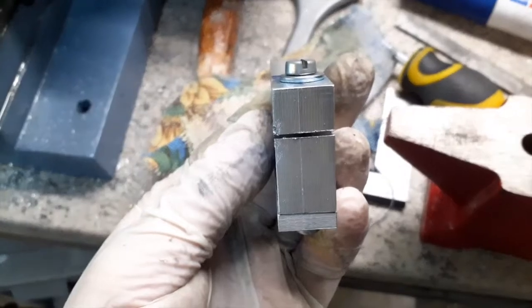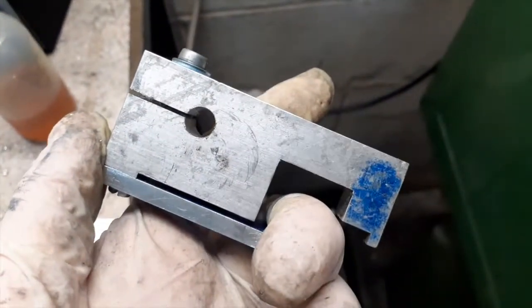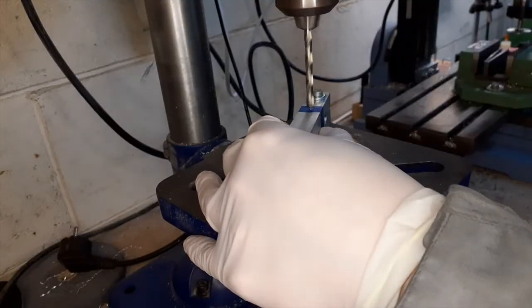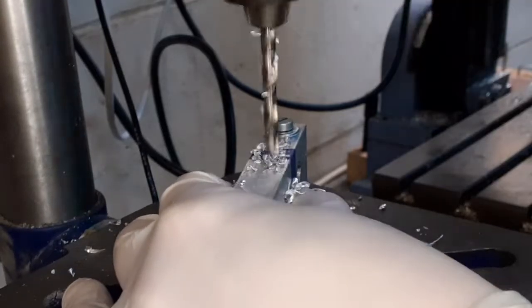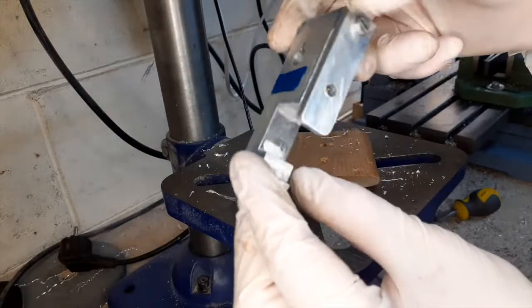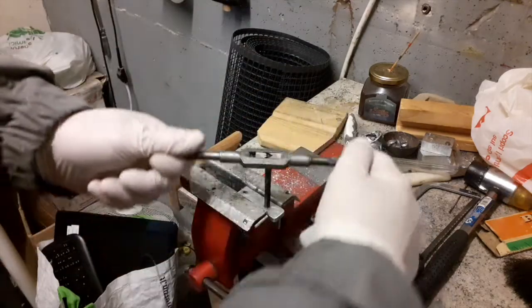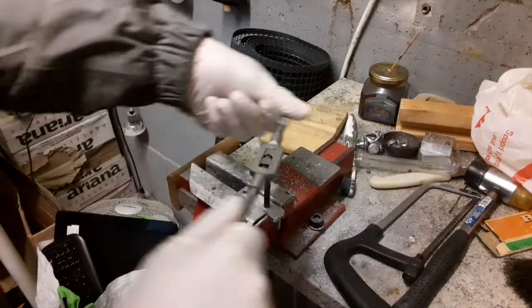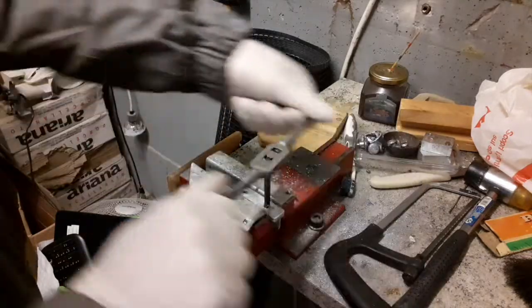You can see it clamps the micrometer in this hole. Under it you can see the other part that clamps the whole assembly. Now I will drill the hole that forces the clamp to retain the piece on the bed of the lathe. This is the finished part — we have a screw here, and some tapping action on the clamp. The screw goes through the entire piece and screws onto this part to make the clamping action on the way of the lathe.